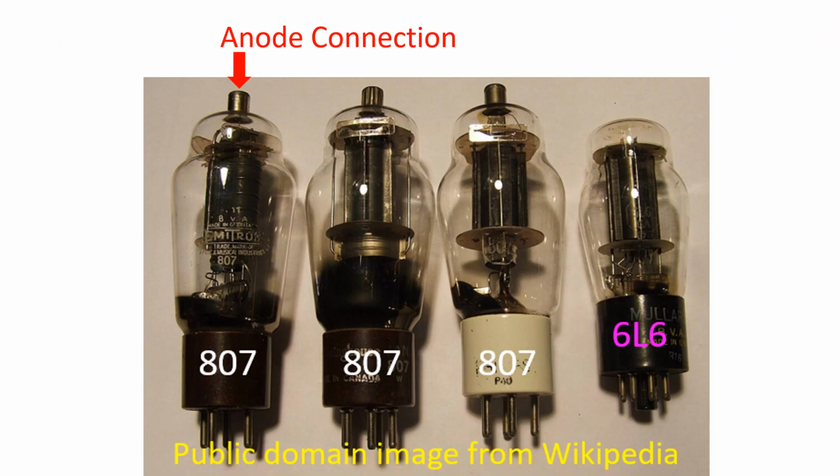I remember that the anode cap of the 807 vacuum tube connected at the top was a potential shock hazard, with the full rectified DC voltage from the transformer reaching there. One had to be extremely cautious while making adjustments with the cover of the enclosure removed. Similarly, the high voltage filter capacitors in the power supply had to be discharged using a resistor before handling.